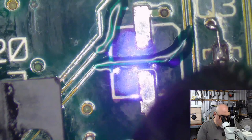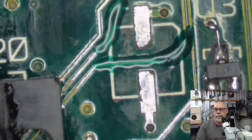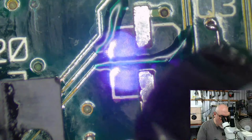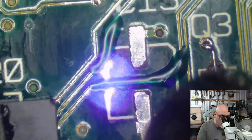But of course, I will probably make this change at some stage fairly soon. I'm probably going to change over to the polymer capacitors. They look like electrolytics, but they actually have a polymer, like powder, inside as the electrolyte rather than a liquid. They're still a bit more pricey than the tantalums, but the price of those is going to come down and it'll all equal out, and then I'll probably just end up using the polymer caps in the future.